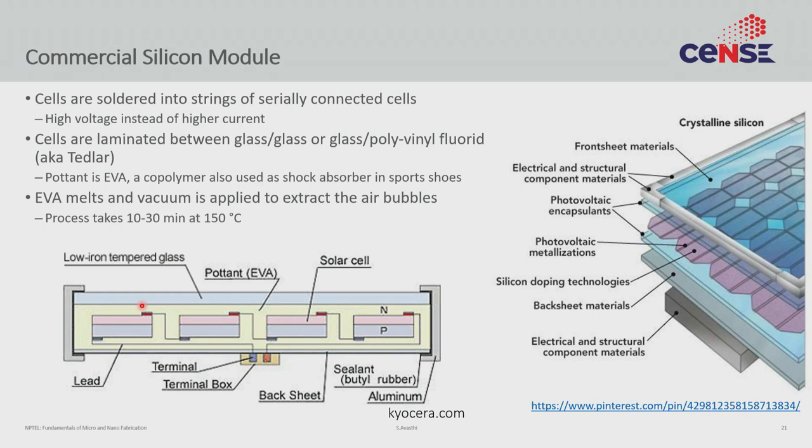This is the cross section and front view of the module. You see the aluminum frame, the front glass, the wafers, the encapsulant which is the EVA film, and then the back sheet. You see the bus bars and individual wafers connected. Finally, a junction box is attached, connected to the output wires. That is what a module looks like. The aluminum frame provides rigidity so it can withstand some abuse while being installed.